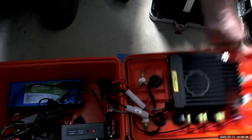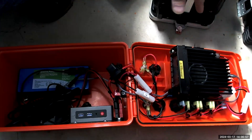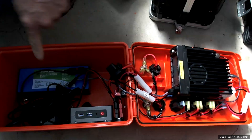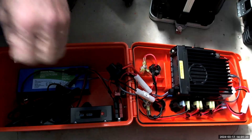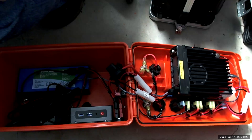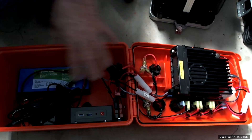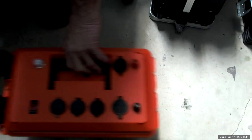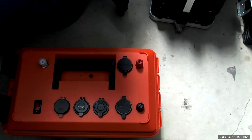Here's another project we built for the City of Calabasas. They wanted field-deployable Winlink clients and gateways, and this is the gateway variety. It's all built out — there's the Alinco radio, we used the RIM boards for these, and there's the puck PC. We put in a 12 amp-hour battery, plus there's a port on the outside to either charge it externally or add another battery, and an antenna port on the outside. We can take these boxes, place them somewhere with a known Wi-Fi signal — already configured in the puck PC — plug it in, turn it on, and we have a Winlink gateway or digipeater deployed. It's self-contained: once you turn it on, you can close the box and it runs.